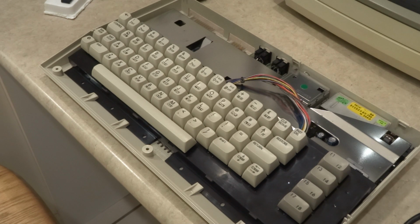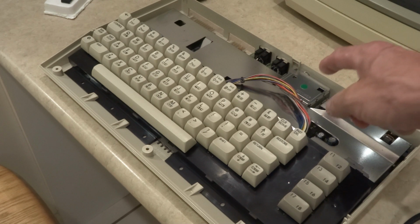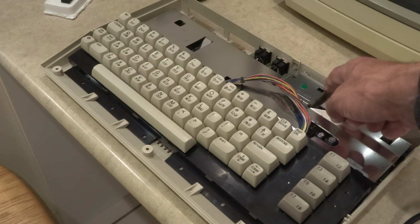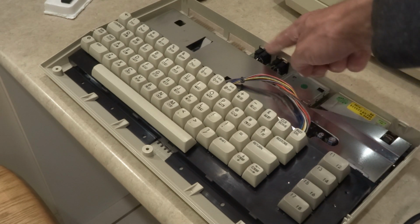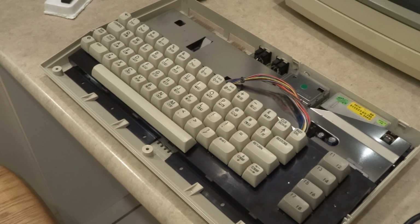plus if that PAL modification actually turned it into PAL. Now, one thing to remember is it's fine here, but that PAL jumper, just like if you can do it with the Amiga, this RF modulator will always output NTSC. So what happens on this end, if you have converted to PAL, but it's actually a PAL machine with the composite and all the video output geared for PAL, even though you can play games on it, if you have something that can't understand the color signal, you'll get, like this monitor, it'll display, but the image will be black and white.